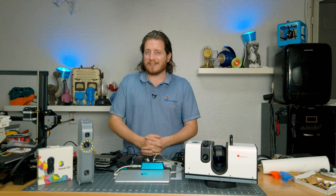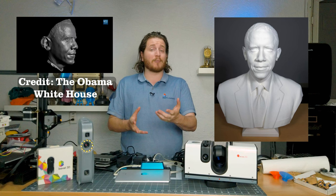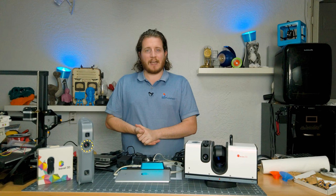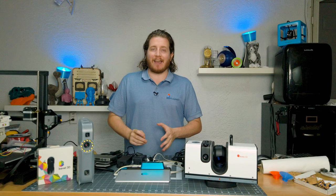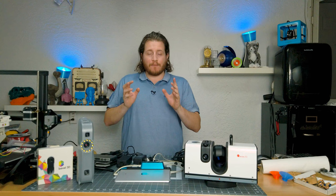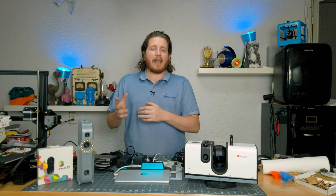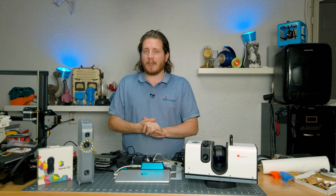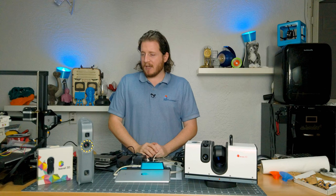If the EVA is good enough to scan Barack Obama — and yes, the Artec EVA is responsible for that 3D model of Barack Obama that most people have seen and some have printed — then it's good enough for government work, quite literally. It does have some downsides: a lot of these structured light scanners require a direct computer connection, making them bulky, and the larger ones pull so much data they need a powerhouse of a computer. We currently use a Ryzen 3750H processor and a GTX 1650 — an older computer, but it's capable of running the EVA at about 14 frames a second max, and the EVA is only capable of 16 frames a second, so a three or four-year-old computer is running it at 80% of max speed. That's great.